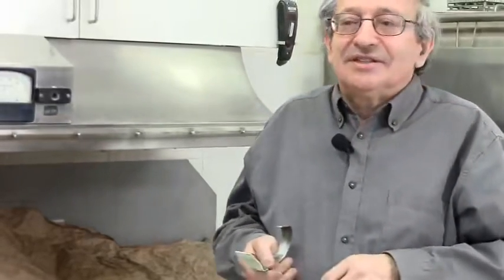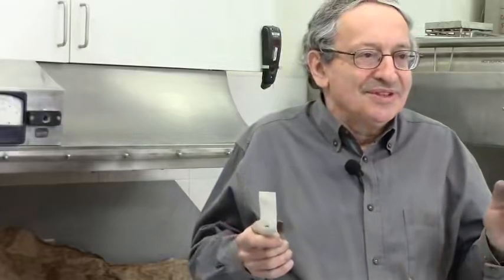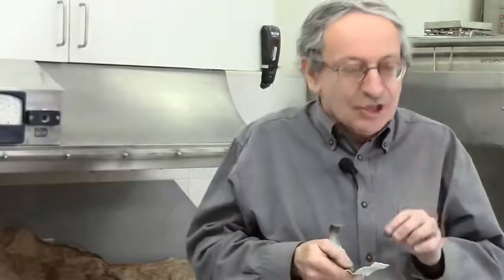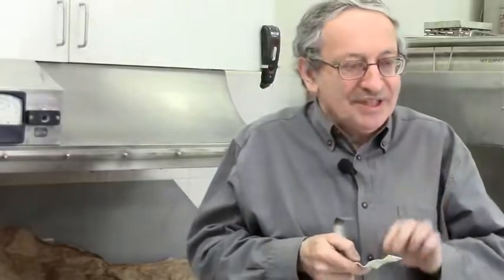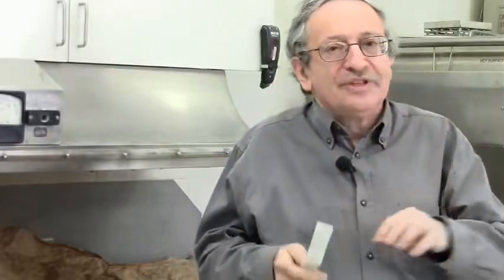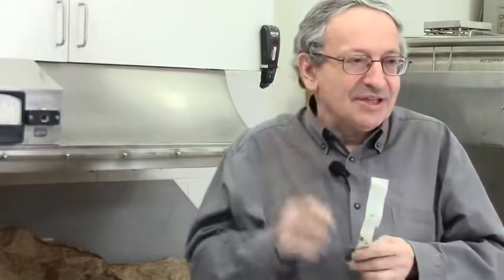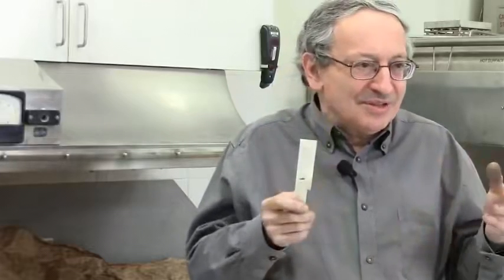Okay. The second reason you can't is if the sheet metal is very, very thin. Because any metal thinner than say 0.5 millimeter, if you sandblast, will completely distort. The reason is the sandblasting is like shot peening. It will put in compressive stress in one side and the piece will immediately bend. If you flip it over and sandblast the other side, it will straighten out, but never perfect. So if something is made of very thin material, you cannot sandblast it without distorting it.